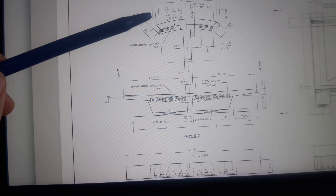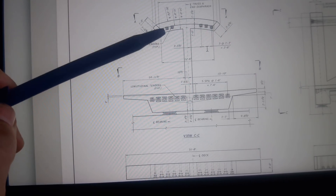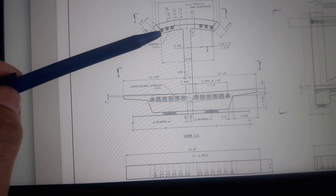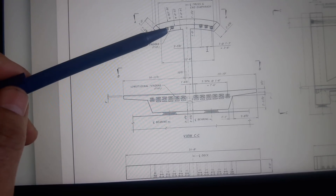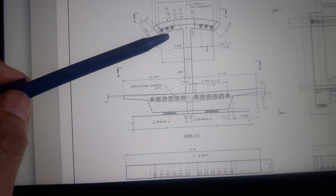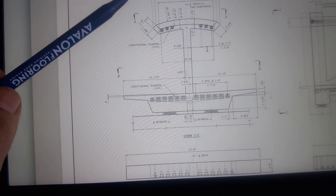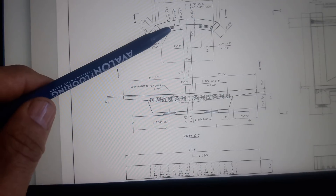The amount of concrete cover here is very important — specified elsewhere in the plans. Around these longitudinal tendons there are only six — engineered to be six. I don't know what redundancy is built in — maybe they only needed two, maybe the redundancy is a factor of two, or maybe they needed 100,000 PSI cable and they used 400,000 PSI cable.